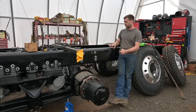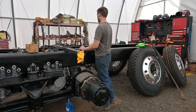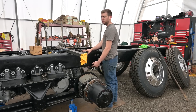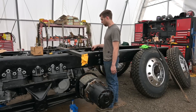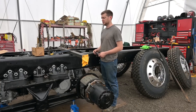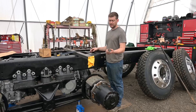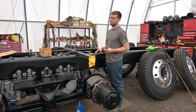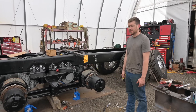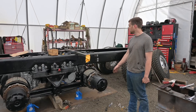That's how easy mounting all of this up would have been if the holes are already there — lift it up with an overhead crane, clunk clunk, you don't have to weld it. At the Primax, it's got those two hangers on the top and bottom, it just grabs the axle saddle, two u-bolts, tighten it down, little adjustment screw for wheel alignment. You don't have to change out wheel studs. When you hit production, these things don't happen. This is purely prototype — this is why nobody builds a one-off truck for themselves. I never in a million years would have considered that the studs would be a half inch too short.